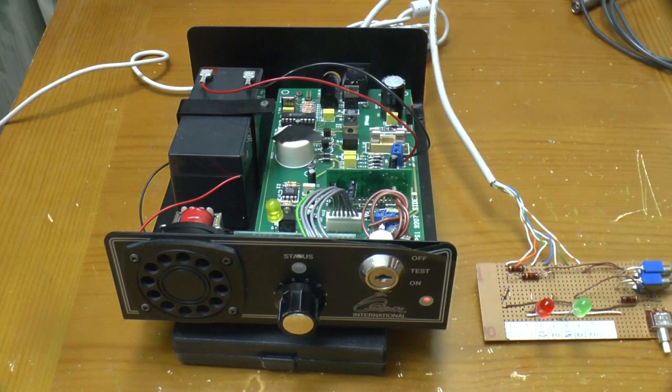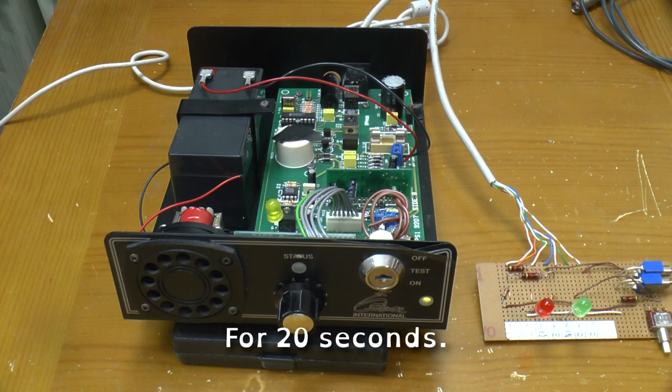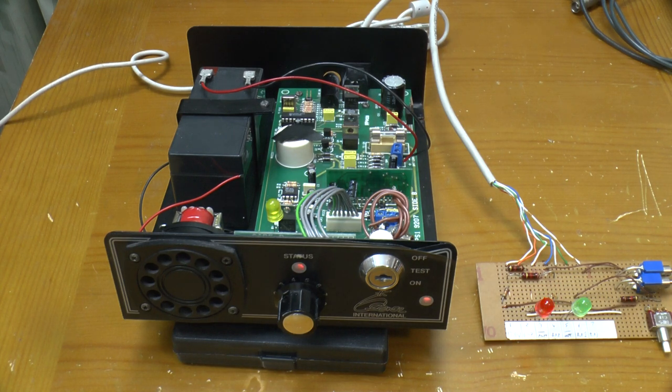Triggering it sets the entry timer off. Flicking the switch off at this point will obviously turn off the alarm. Leave it though. And the siren triggers, along with the alarm output. And again, 10 seconds later, this secondary output. 5 minutes later, it just drops the outputs and rearms itself. The only difference is now it's got a red light indicating that it has been triggered.